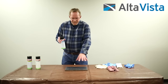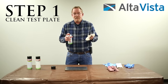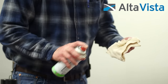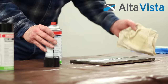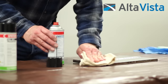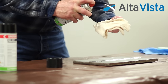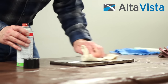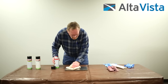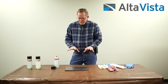The first step in the procedure would be to clean the test plate. I will take the cleaner and use a lint-free cloth — that's key. You can't use paper towels; you want to use a lint-free cloth. If it's really greasy or dirty, you can spray directly on the plate. This plate is very clean. Hopefully you're in a nice, well-ventilated area. Make sure you get along the toes of the welds very well. Then let that set for a minute and let it evaporate.